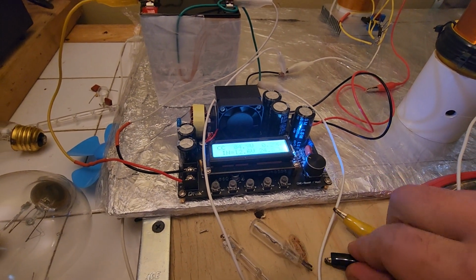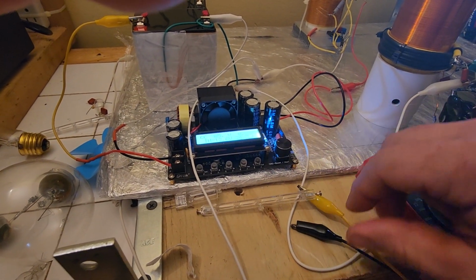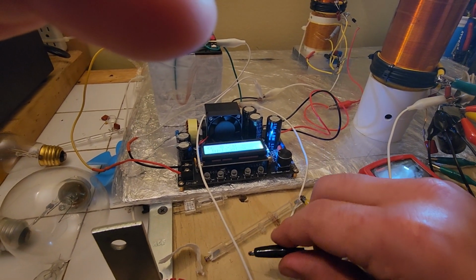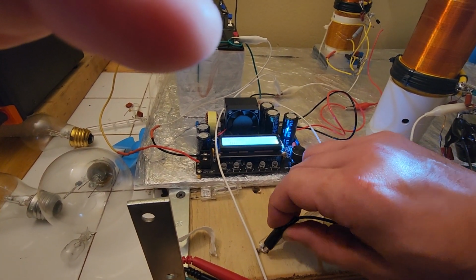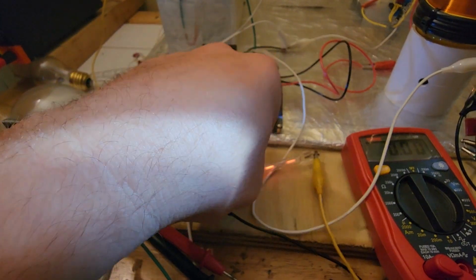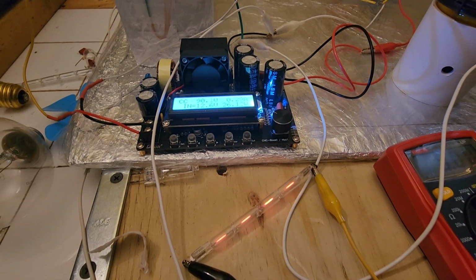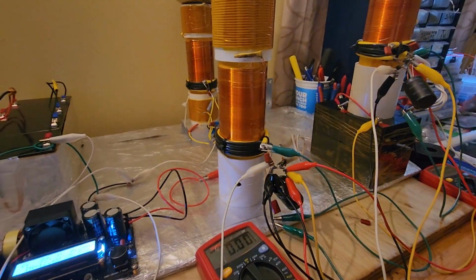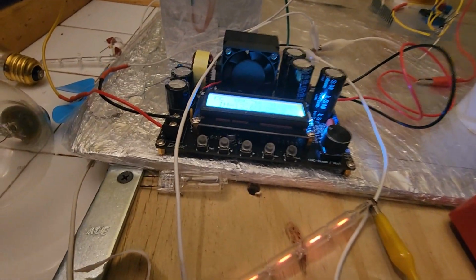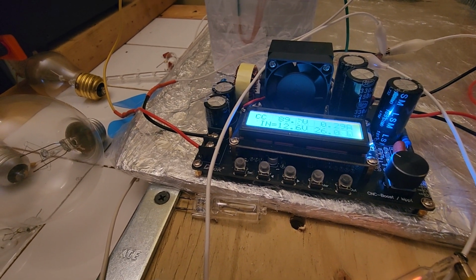And I will connect up this big bulb. As you see, it did burn the wood here a little bit. And you really don't want to touch this output. It'll really hurt. If I got this to 100 volt output DC with high current, it would be painful. You almost have to start respecting the power of the system now. So this is the raw current output of our receiver coils and our ground extraction circuitry. And because I did so much tuning with this bulb instead of the big one, I believe it's slightly impedance mismatched, causing us to draw a little bit more current from the transmitter.